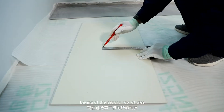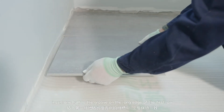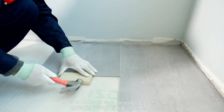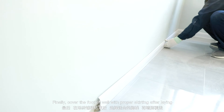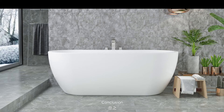Laying of the second row of tiles. Cut the first tile in half and insert one half into the groove on the long edge of the first row. Then knock the second tile into the groove of the first tile and so forth until the floor is fully covered with tiles. Finally, cover the foot of the wall with proper skirting after laying.